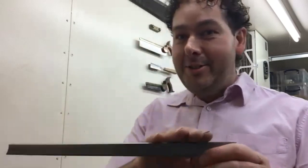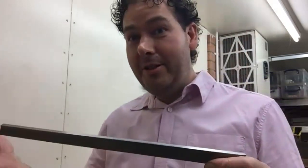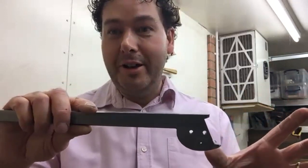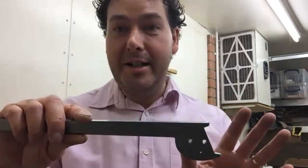So this is an English saw with 3 bolts in. This is my saw with 6 bolts in. This is a traditional back saw. This is a skew back saw. It's better because I don't have to put the nib on and I've cut some time out. I don't have to shape a tongue on a handle because I've now put flat sides on it. So all he's done is speed up the manufacturing process.